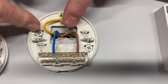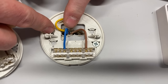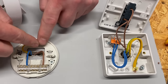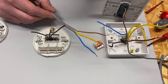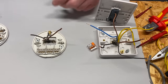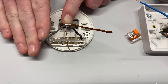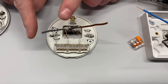I'm going to remove the twin-and-CPC cable from the ceiling rose and replace it with a three-core, then look at the connections at both ends. During the first-fix stage, rather than pulling twin-and-CPC from the switch to the lighting point — chasing walls, lifting floorboards — pull in a three-core-and-CPC instead. Same effort, same walls to chase, same floorboards to lift, but you gain that additional conductor at the lighting point.